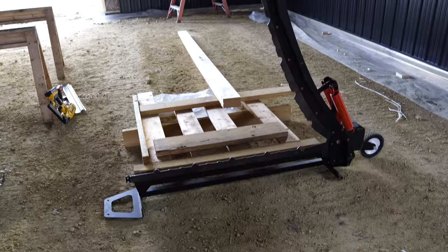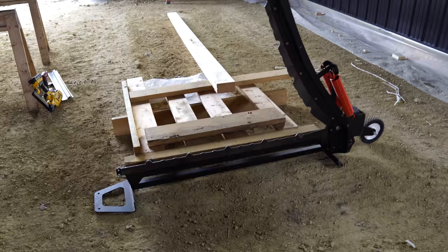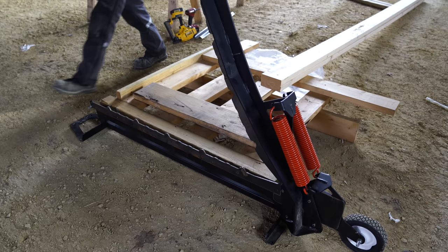We measured from our trim to our ceiling trim here, and we're going to go ahead and shear all those down. We could use the nibbler and cut them, but that is super painfully slow compared to the Swenson shear. And this is kind of a godsend when Kyle makes mistakes on ordering, which has happened probably 3 times now. We'll set ourselves up a little jig so we can just put the sheet right down. This thing acts like a giant scissor, and the good thing about it is it makes a really nice clean cut, just like factory, only with a lot of manual effort.